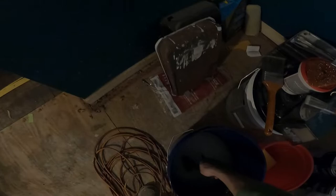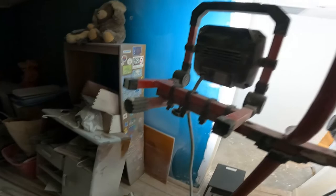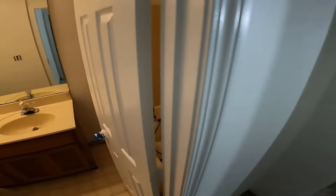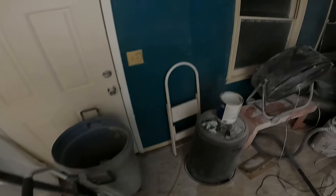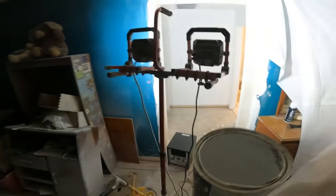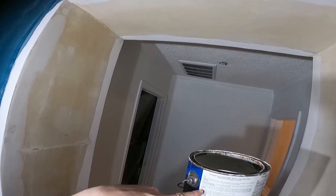It's cleanup time. This is another reason we have the water bucket. Most cans will tell you: apply only when surface and air temperatures are above 50 degrees. It's been down in the 40s outside tonight, so I keep the heater up here just to keep things warm. It's cold out here — not below freezing though, and that's good news. Anytime it gets below freezing I typically don't do any painting because I can't do cleanup. My hose will freeze — this is actually a new hose because my other one froze and broke.